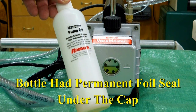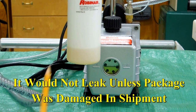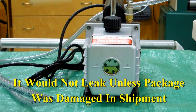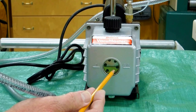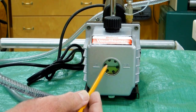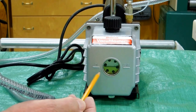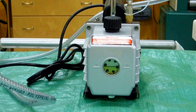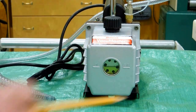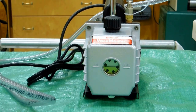This comes with a small one-pint bottle of oil. When I filled the pump, I've got about half left. You put oil in until you see it start to come up, then go ahead and start the unit and let it run, gradually adding more oil until you get to the proper oil level, then quit filling it. If you don't pay attention and dump the whole bottle in there, you overfill it, and when you run the vacuum pump it's going to blow oil out. You'll get some oil vapor out of here anyway — that's nothing to worry about.